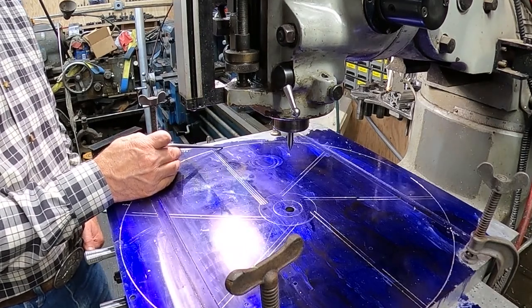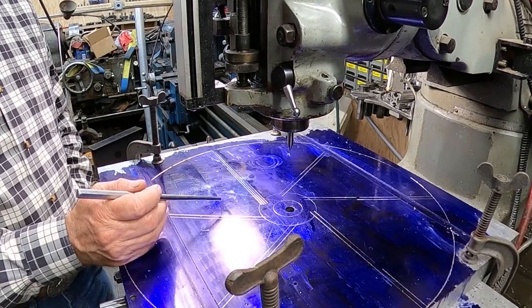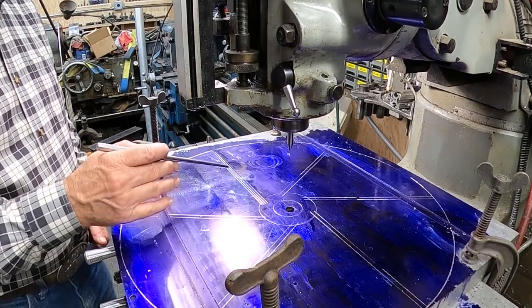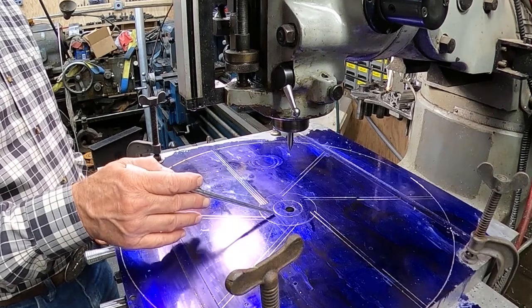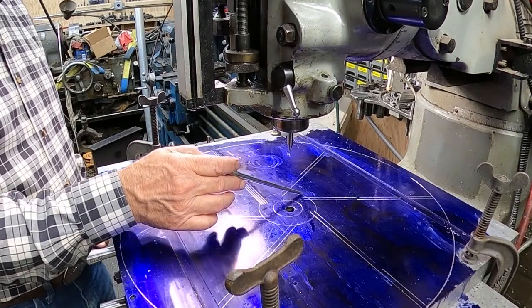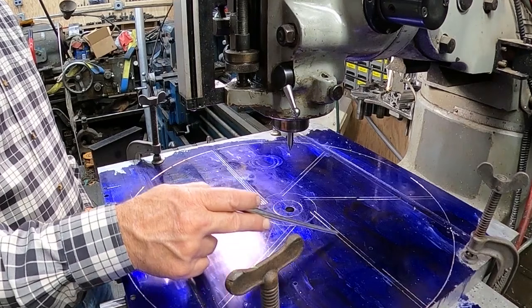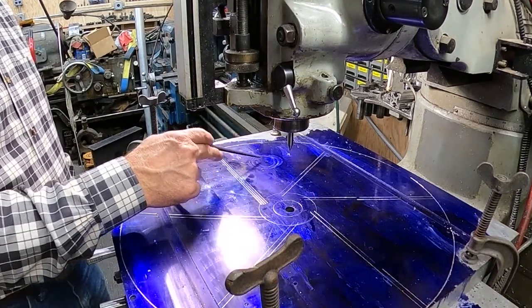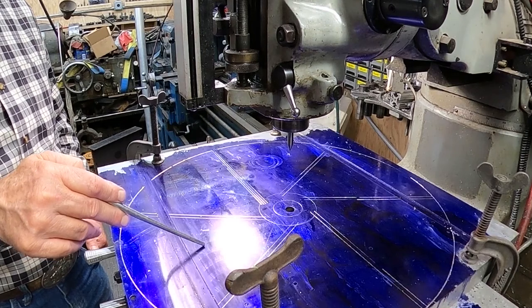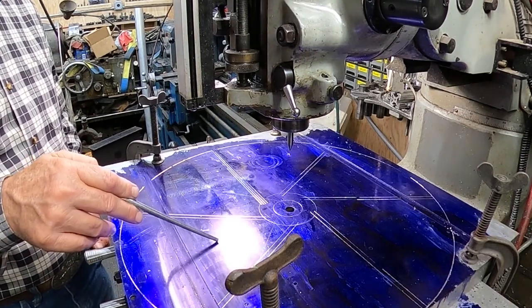I wanted to have 20 inches. We're not quite going to have 20 inches across. So that's what we're going to try to achieve. So the shoulder is going to remain the full thickness, and we'll round off these edges all the way around. And as you can see, these are going to be the fins that go into it. The base around this will be lower. We're going to take that down almost 7/8 of an inch.